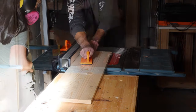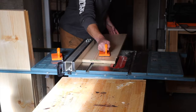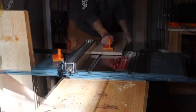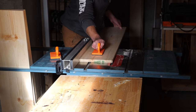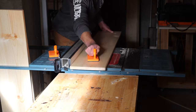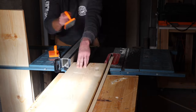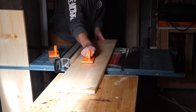After I've got my straight edge, I'm just trimming up the other end. I took the thinnest boards and basically used those as my template, so I have a uniform depth on all of my boards. And I'm trimming up the opposite edge from my straight edge that I created.